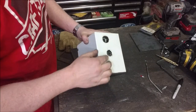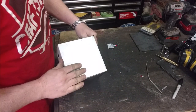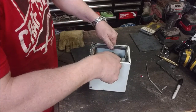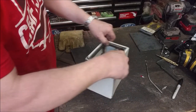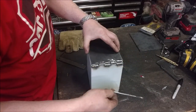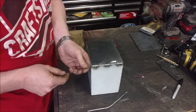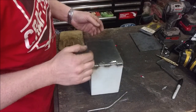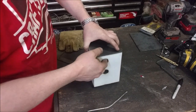I just took some thin-gauge sheet metal and bent it all the way around on all sides. It's fastened with just two screws, so if I ever need to take the shielding off I just undo those two screws. I've also worked up a hinge — I just used old brake steel brake line, cut it into little segments, and welded opposing pieces on each side. Jam a wire through it and you have a hinge. Now I just need to make some sort of latch and a handle.